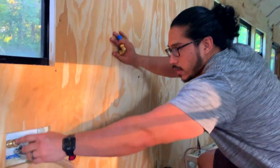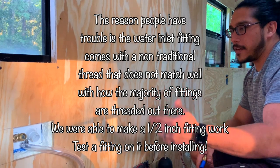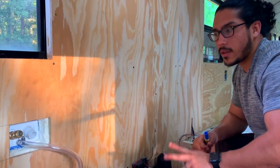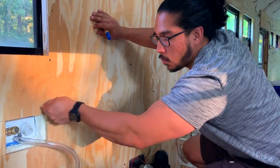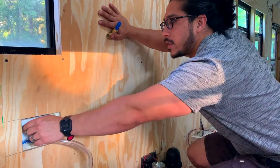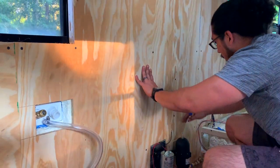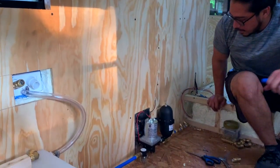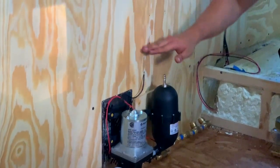This connection was very difficult — we've heard a lot of people have problems with this actual water inlet. For us it fit the way it was supposed to, but because we had already installed it, it was very hard to put the Teflon tape on, and very hard to screw it on as much as possible. Not only that but this is also very flimsy, so I couldn't just grab one side and turn it — I had to get two sets of pliers to turn both of them. Other than that, we're going to keep going — we're going to install our city water, running from here to an elbow, elbow to a wall elbow, and then to this area right here. This is all going to be cold water. We put a check valve right here to make sure water coming from the pump doesn't go out that way, and we're also going to be putting another check valve for the city water side.